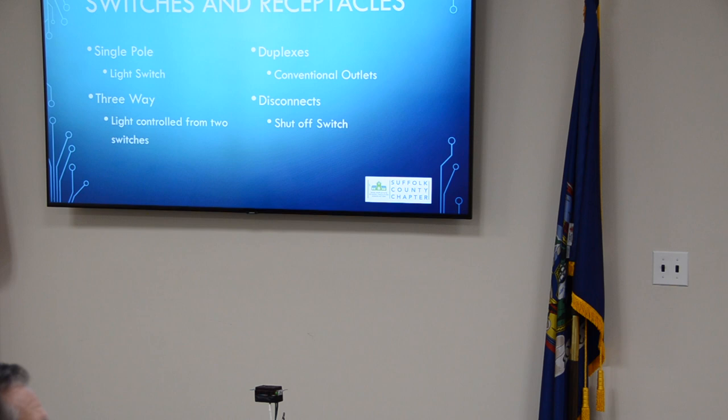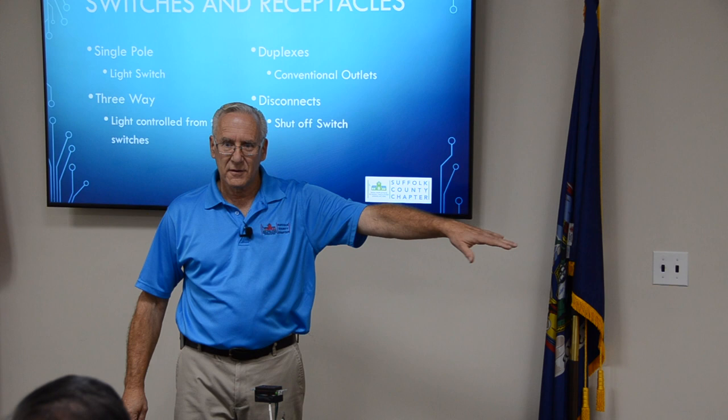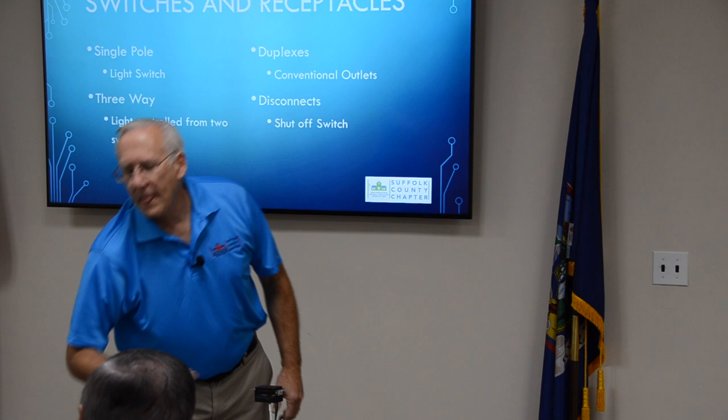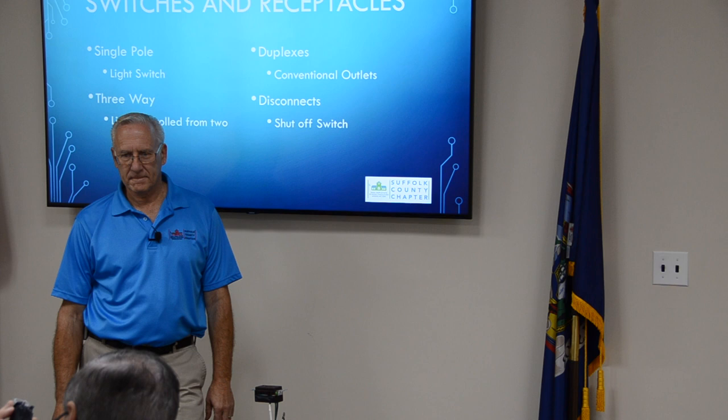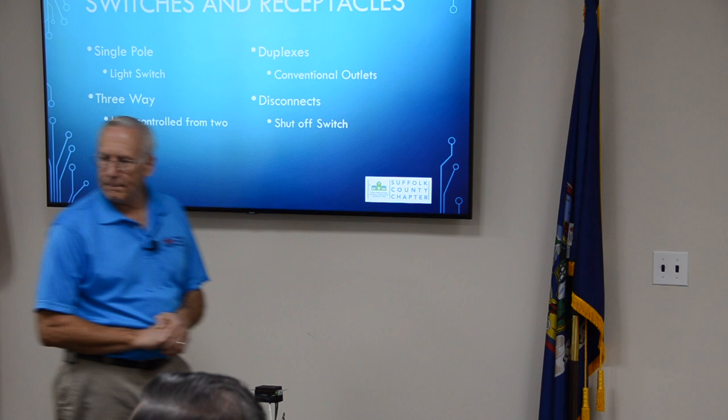You never saw one in school? Usually in corridors, long corridors, they have four-ways. Sometimes you don't even notice that they're there because one switch nobody ever uses, right. So it never changes position. You know, take a look at a four-way switch. Four terminals. And there's an obvious, it says this side up too. So there's only one four-way switch in the circuit. Yeah. And then two three-ways.